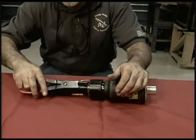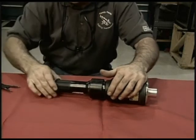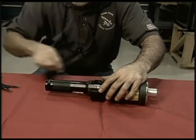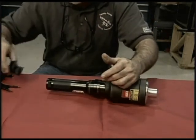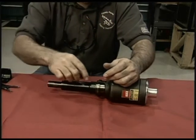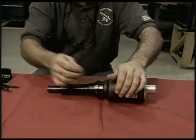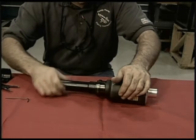If you need to install a different diameter nose, or to use the optional Huck spin collar cutter, simply reverse the assembly process. Remove the true arc ring, pull off the lock ring, remove the half shells, remove the anvil, remove the set screw, and unscrew the thimble from the piston.